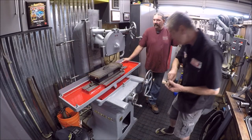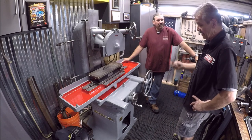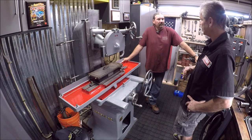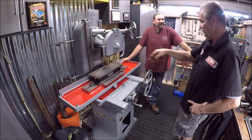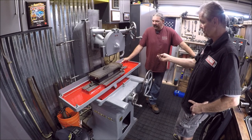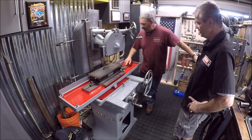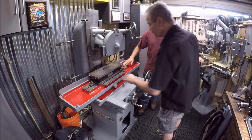I did a little welding on these right here, and I think we fabricated these parts. I ran it side to side and thought it was off half a thousandth until someone brought to my attention I had it in tenths — so it's off five tenths from one end to the other, and that's an 18-inch chuck. It hasn't been ground; all I did was clean it up and stone it just to get off any burrs between the chuck and the bed. And it's hand scraped over the top.